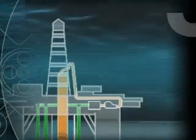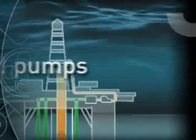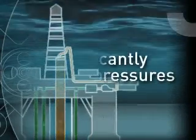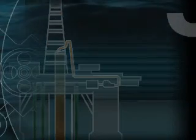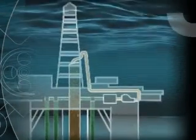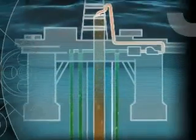Your journey begins at the rig's mud pumps — the pumps located on the rig at surface in the pump room. These are standard equipment, no change, but they will run at significantly reduced pressures compared to conventional drilling applications. Expect the rig pumps to last longer, require less maintenance, and require significantly less power. The rig pumps will pump the drilling mud from the mud pits up the standpipe and into the drill pipe, as always.